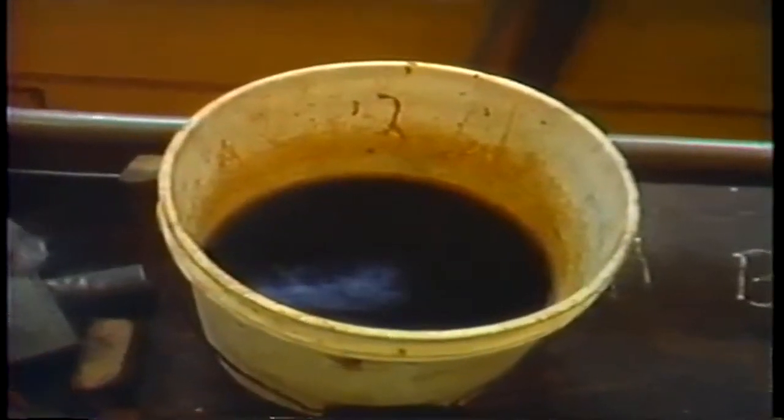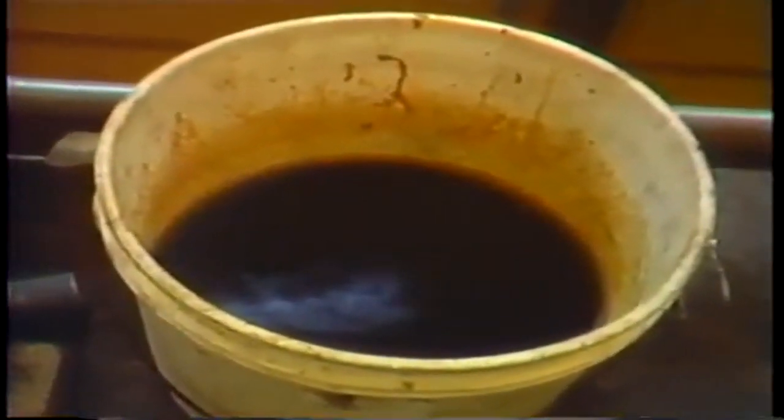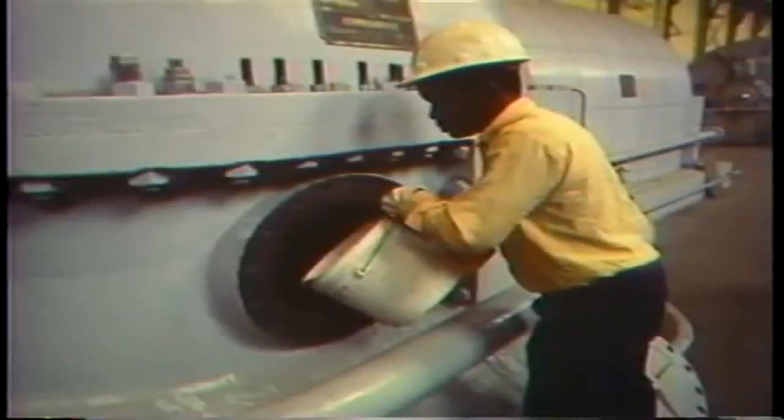To check for leaks in a surface heat exchanger, you may use a dye check or you may perform a vacuum test. Now, these might be done while the component is in service, or they might be performed while the unit's down after it's been cleaned. After cleaning, a visual inspection is done for evidence of corrosion, cracking, or to look for any more blockage. While some heat exchangers are in service, a telltale dye can be added to the water going into them to look for any leaks.